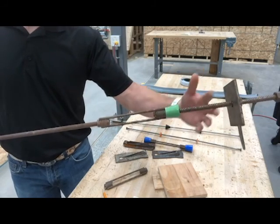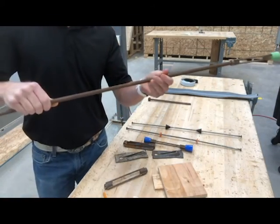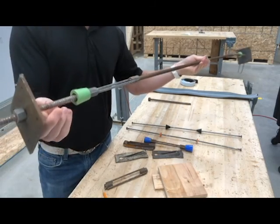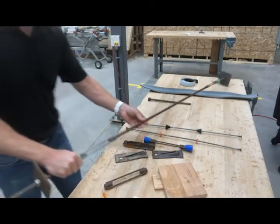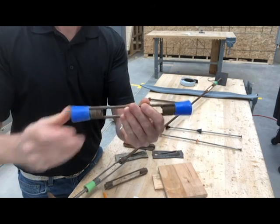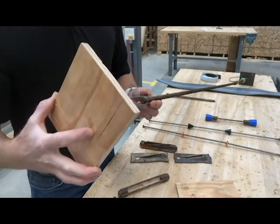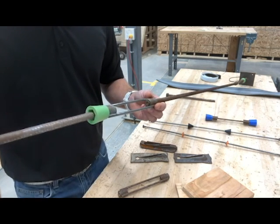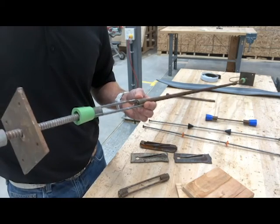So we can put studs, whalers — we could even put I-beams. We can put whatever we have out there through that. This thread is very adjustable; we could cut it to whatever length we need. On the other end we have another coil tie and another cone — the same concept on this side. This one doesn't have a big wing nut so we'd have to use a wrench on that. These coil ties and cones just look like this — cones slip off and go back on. At this end of our coil tie, the cone and form ply go in here with a hole where the threaded rod goes. Before we stick that threaded rod in, we want to put some petroleum jelly on it so that when it comes time to strip the form it comes out nice.